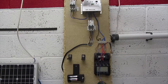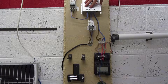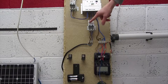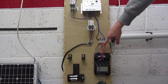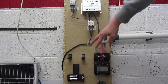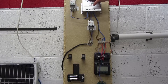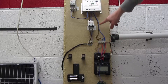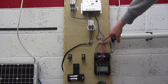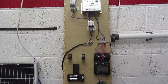In normal operation, the power will come in here, be converted from around about 50 volts down to 12 volts, go off to charge the main battery bank, and also power the little AA charger and lithium charger. Now when the sun goes in, there will be no power coming from the panels. So this will then take power from the main battery bank — the big ones along the bottom — and carry on feeding these little chargers. So I've always got power available to the little battery chargers.